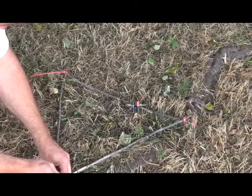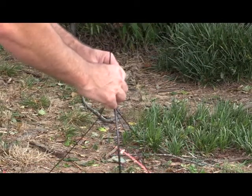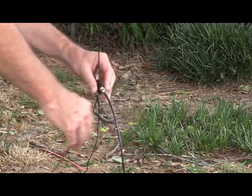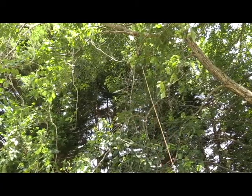On your leading end that goes up to the 550 cord, you're going to bend over about a half inch, and that will connect into your 550 cord — I just use a simple bowline knot. We'll connect our coax to our banana connector, and then we're going to hoist our antenna up in the tree. Don't let the wire touch a branch or a leaf if you can help it, as that can detune the antenna. I like to use about six inches to a foot away from the branch I'm hoisting over.